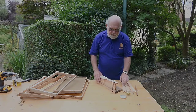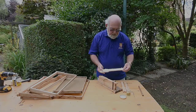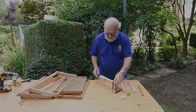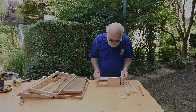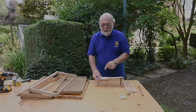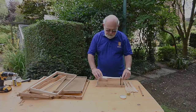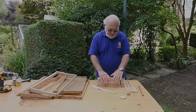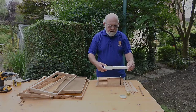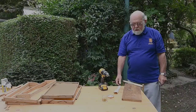A long time ago I thought there must be an easy way of drilling these. This is a template used for marking up the holes on the bars — a thin piece of metal with holes drilled in. I thought I could drill several bars at once and so made a little clamp, but the problem is if you put a long drill through a great stack it goes off centre and comes out at the side. So you can drill them in ones and twos but not in a great stack — that was a no-no. But I still use this metal former for marking out the holes in the sidebars.